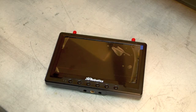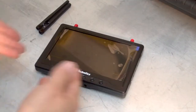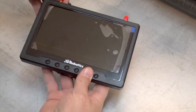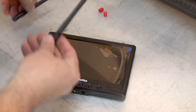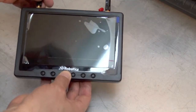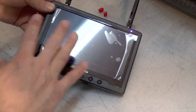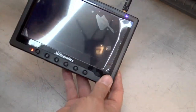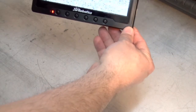Make sure your monitor has a full charge. Take the included charger, plug it into the side of the monitor at the DC input, and the red light will come on indicating it's charging. Once the light turns green, the battery is fully charged and you have an hour and a half of battery life. Once charged, remove the protective covers and install the two antennas marked 5.8G on the bottom — they simply turn on hand tight. To power up, hold the power button for 3 to 5 seconds until the red light comes on. Your monitor will come pre-configured to the frequency set up on your custom copter, so all you need to do is mount it using the quarter-inch 20 tripod adapter and you're all set.